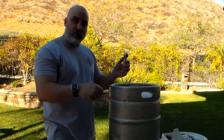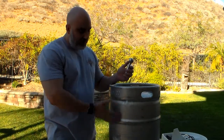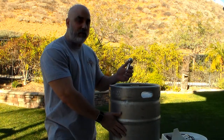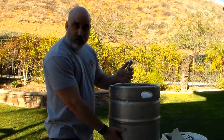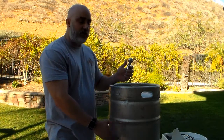I can actually do a visual inspection with a little mirror and see that the whole thing's clean, without ever coming in contact with any of the walls. It's all done through water pressure and chemical action. Obviously I can't visually inspect easily inside the keg, so today when I demo it, we're going to use a better bottle — a clear plastic bottle — to show you the spray pattern of what's going on inside the keg when it's getting cleaned with the CIP ball.